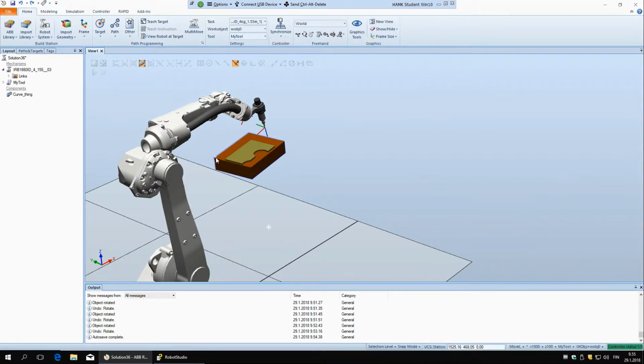And then when we have the actual robot, we can actually do the same. We can take the robot and show it the position of these 3 points, and we can say, okay, this is the coordinate system that we have defined here. And that's why this can be anywhere. When we define the coordinate system, it will always know where those targets are.